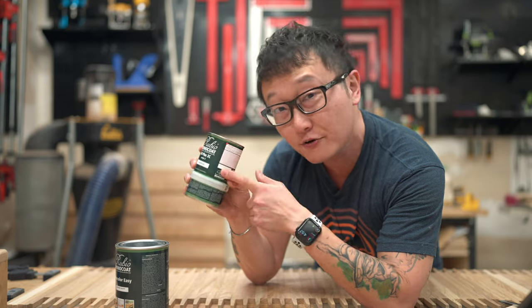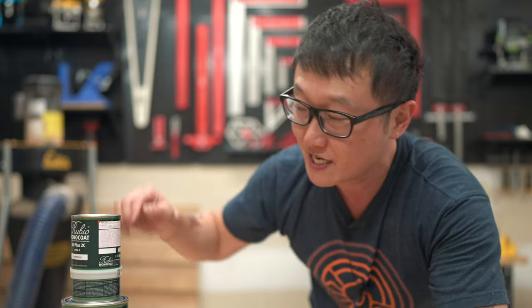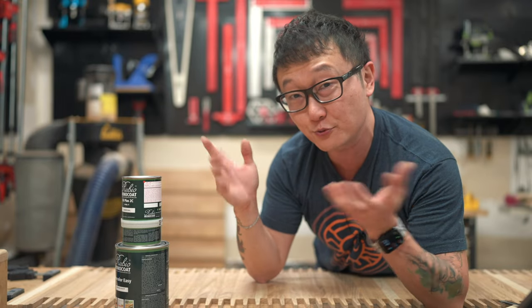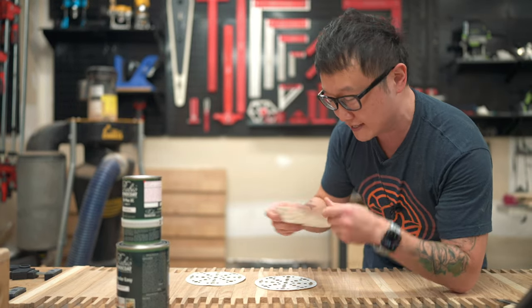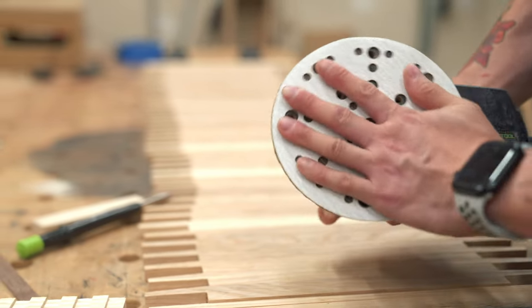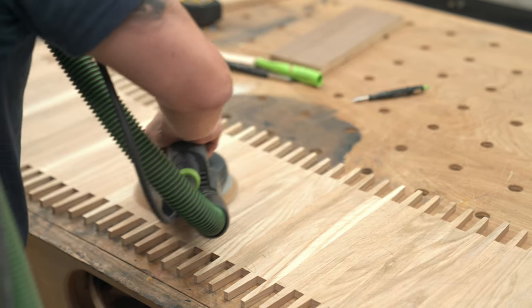This being a hard wax oil finish, it does need to penetrate the wood and bond with the wood fibers. So Rubio actually recommends not going over 150 grit when sanding so it's not going to close off the pores too much and affect how the oil penetrates. But I've actually never had any issues going up to 180 grit. So we're going to start with 120, then 150, and finish off with 180 grit. We're going to use a random orbital sander to go over all the larger surfaces — the trick is just to take our time, go slow, and let the sander do all the work until all the pencil marks are gone.